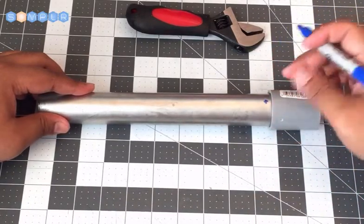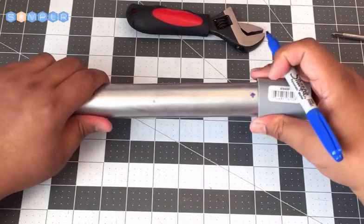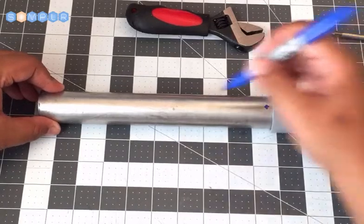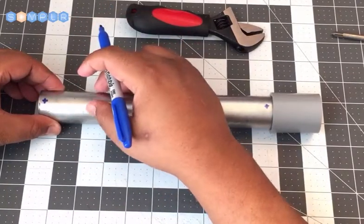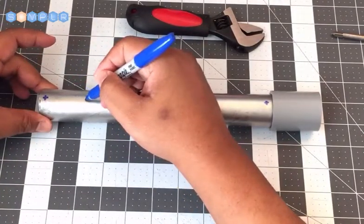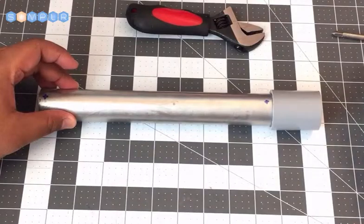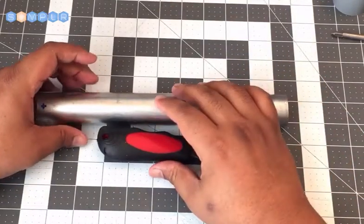What you don't want to do is drill a hole and then when you put your pommel on, that hole is covered. So just flip your pommel piece on — it doesn't have to be tightened — just to give you an idea of where you want to drill your hole. Then go to the other end and mark where you want to drill your hole on that end. The closer to the edge the better, so you maintain a longer length of blade — but not so close to the edge that it makes it difficult to drill.